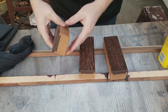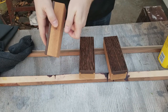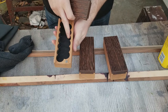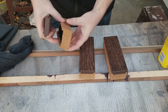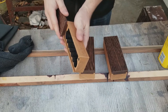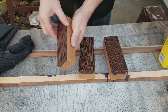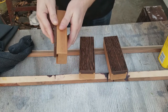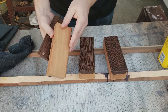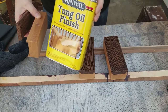Here I've got my boxes. I've sanded down the corners and chamfered the edges with a block plane. The inside concerned me a little bit after painting — this bottom piece expanded so much that the tops didn't fit anymore; they were very loose. You can see how the magnet snaps it to the right place, and it should prevent it from opening when it's in a bag. I've sanded it to 220 grit, and now I'm going to apply some tung oil finish.